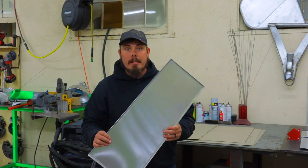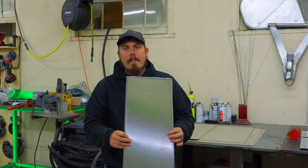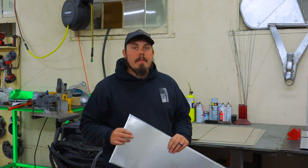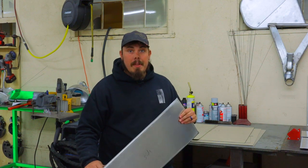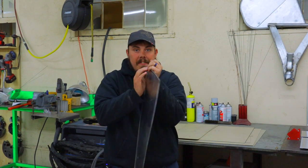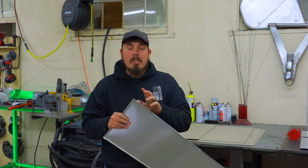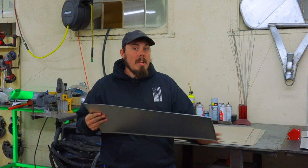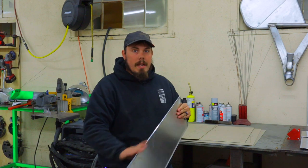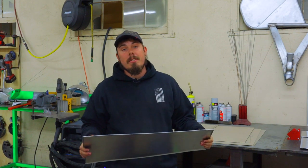You should have your aluminum cut out in raw form. These pieces already have rounded bead-rolled edges, which you'll see in the next step. Not everybody has a bead roller — they can run $2,500 — but don't get hung up on that if you're doing a one-time tank. You can do a regular butt-joint seam weld with a square overlap 50/50, weld that with a heavy bead, sand it round, and it'll look very nice as well. This is just an extra bonus. I plan on making and selling these tanks with different options: one with bead-rolled rounded edges, one with a regular weld. Edges are all bead rolled — we're ready to go. Let's start tack welding this beautiful thing together because in my opinion it's art.